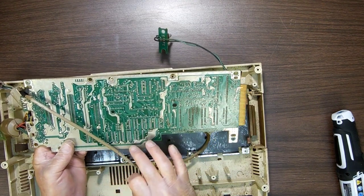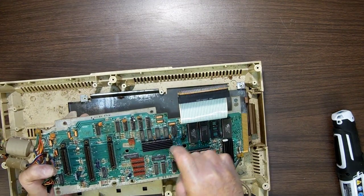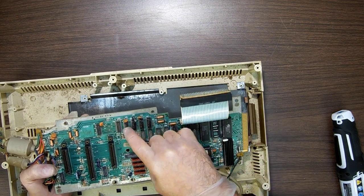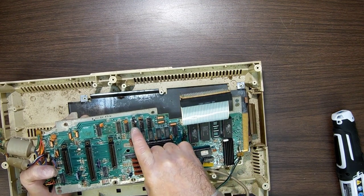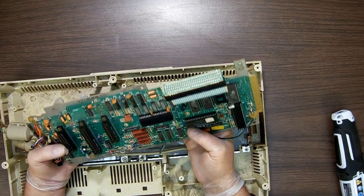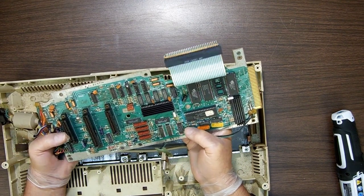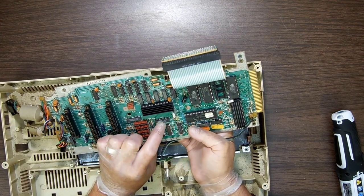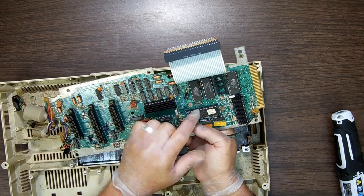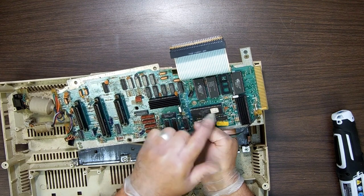It looks like all the original solder is there, all original solder joints. Which is fascinating, that they have four RAM chips by one company and then four MT or whatever RAM chips by another company. I've seen people do this and never bothered to look, but let's see if I can find some date codes on these things. Hey, train's going by. This looks like 1981, 40th week of 1981. These are all obviously 1984s. Well, that's a 1983, that's a 1984, that's a 1983.